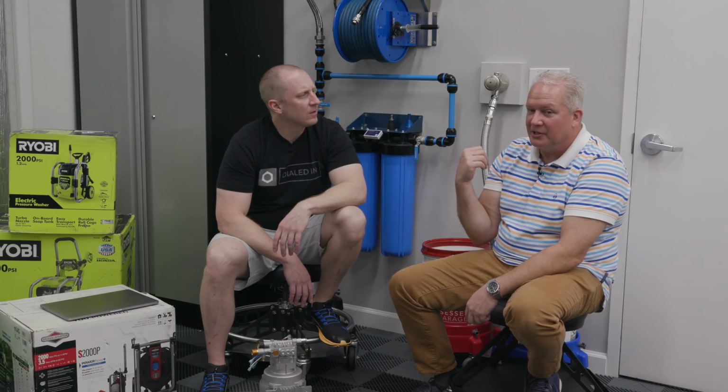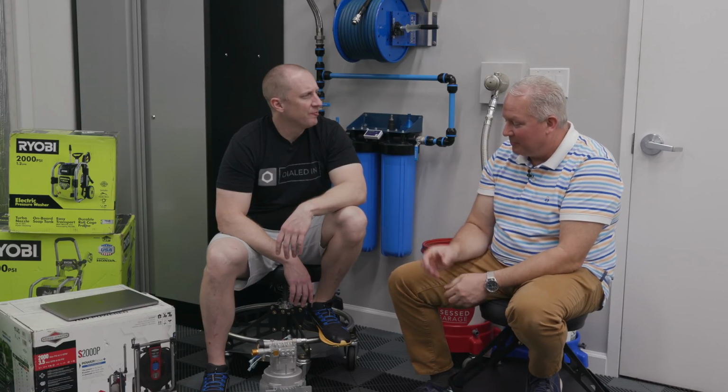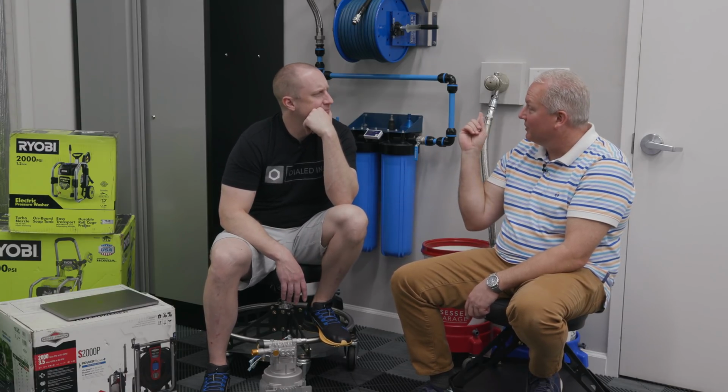And then typically, I saw some of the testing that you did. It was interesting because you were saying, whether I was at 25 feet or 100 feet, I didn't see any difference in pressure. There was no pressure drop. I really wasn't getting any difference in flow or pressure. And the reason for that was the unit came with, probably most of these come with like a 5/16 ID hose, and then you're putting a 3/8 ID hose on it. So you've made up the difference between 25 and 100 feet by going to a larger diameter hose.